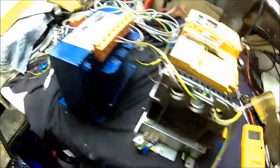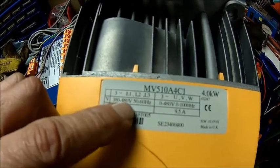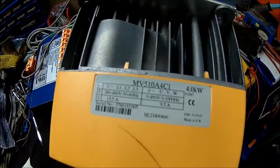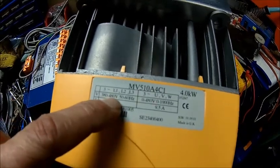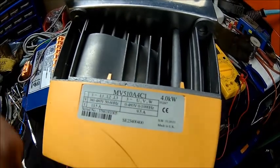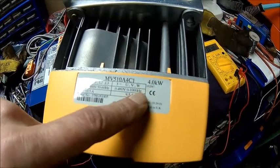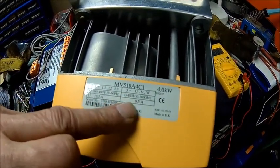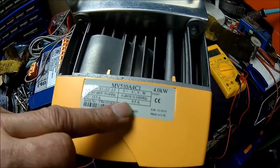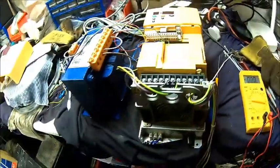The key factor is the rating of your drive. This drive is rated 380 to 480 volts, 50 or 60 hertz — that's the maximum voltage you can feed in. It doesn't matter what the transformer does; the drive makes the output right for the motor. It only does nine and a half amps at four kilowatts, which is not enough to run up a 2.2 kilowatt motor straight away — you need a bigger drive, five and a half kilowatt minimum, otherwise you won't deal with the inrush current.